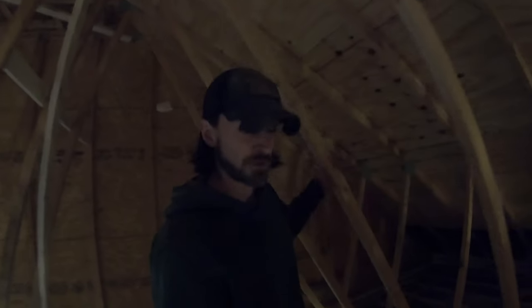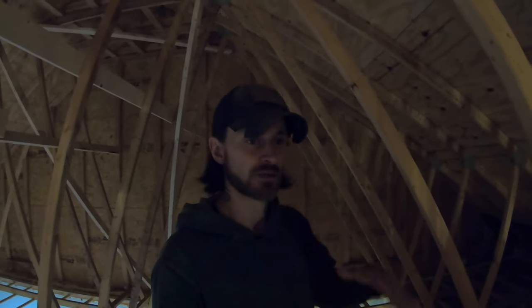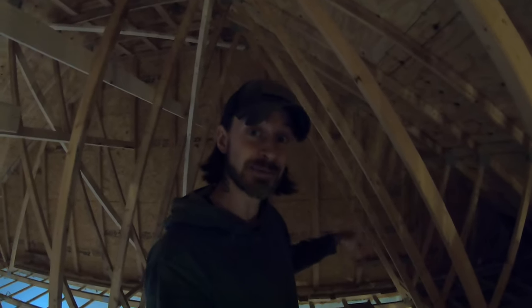So obviously you can see we spray foamed right here, but the problem is if you don't spray foam that, you're gonna get air leaking down through the hole that you drilled. It's gonna go down into your cavity space, and then air is gonna wanna shoot out wherever you have your electrical outlet or your electrical light switch. And that's where a lot of people don't realize their air leaking is coming from. They may look up at their ceiling and be like, I don't get it. My ceiling and mud and tape are all 100%. I'm pretty sure the attic has enough insulation. We should be pretty air sealed. Why is the house so leaky or feel so drafty and cold? It's because of a spot like that.